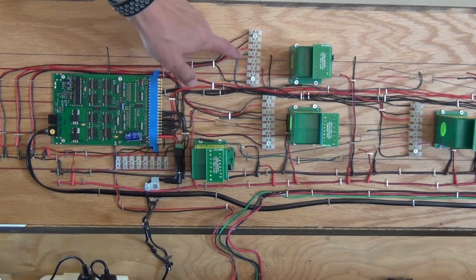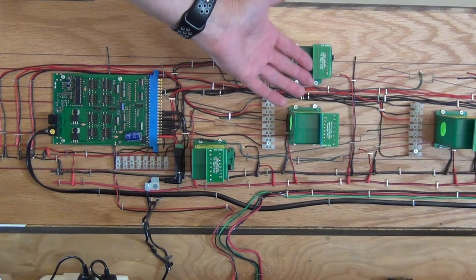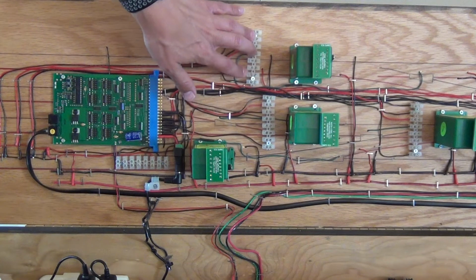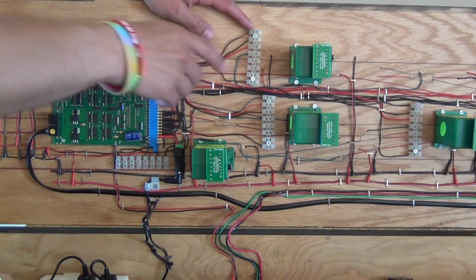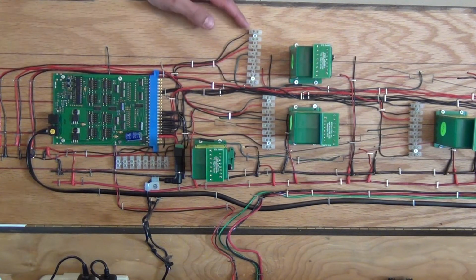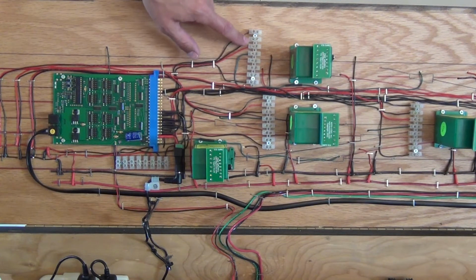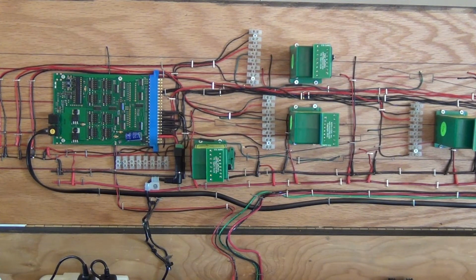And there are still 3 wires here that I'm not going to wire up until I test these out to make sure they'll work. But I am going to run all 8 wires from these snap connectors down here to the terminal strip. So again, knowing that this top is position 1, 2, 3, 4, 5, 6, 7, 8, I'm going to run black wires to positions 1 and 8. I'm going to run black to 2, red to 3, green to 4,